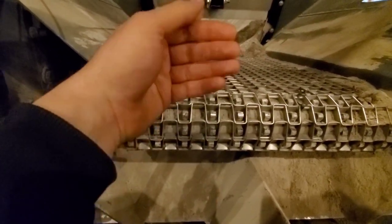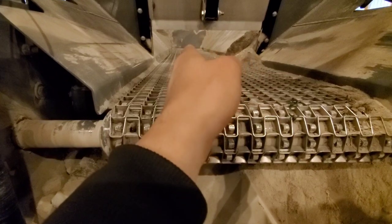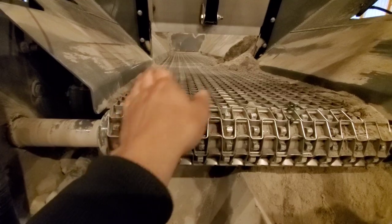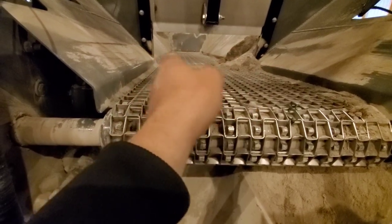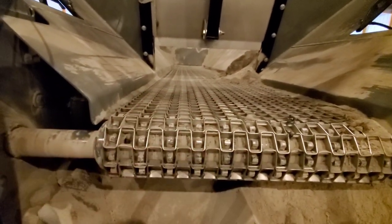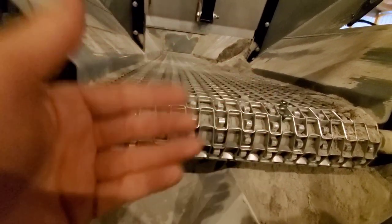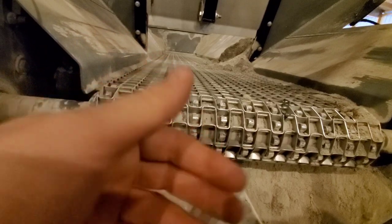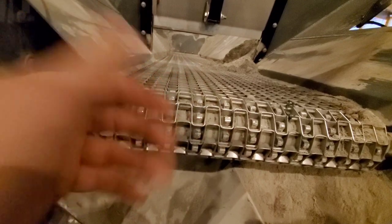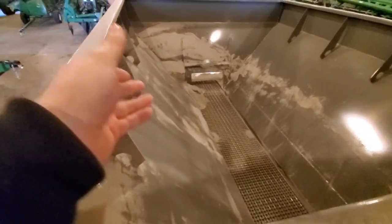In my experience, mesh chain has been one of the best for fertilizer. I never thought much of using it on lime, but being that it's 20 inches wide we have a good contact area and a nice wide door opening. Our L2020 New Leader had a 24-inch belt, but the V's came down over the belt for off-tracking resistance, leaving only 16 inches of active belt. With this mesh chain, you have a full 20 inches, so it handles lime very well. When you get into a true belt machine like a 37-inch wide belt — that's your New Leaders — you're in the neighborhood of a hundred thousand dollars.